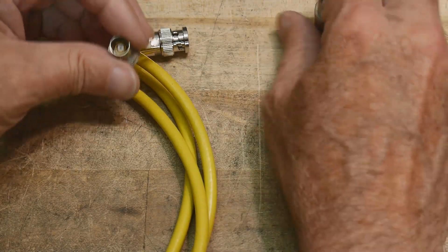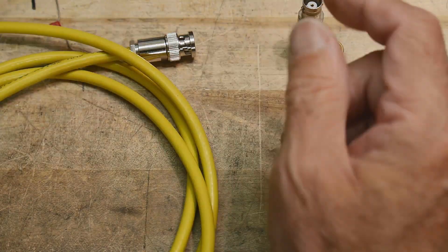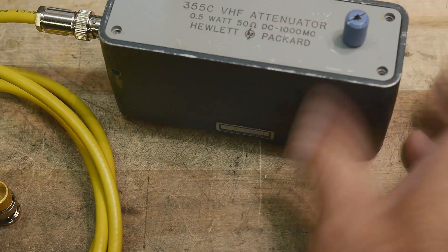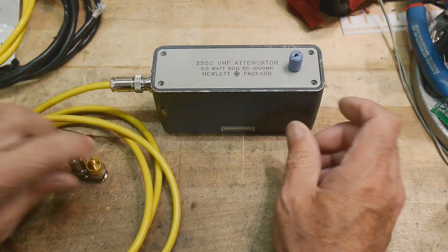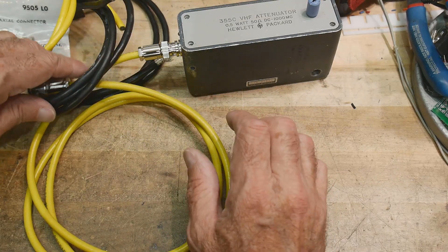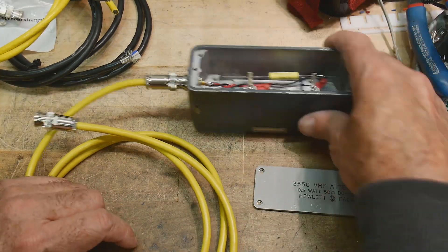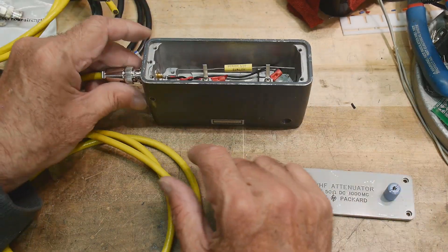I had to file off two of the little nubs, and now I have it working. I had two of these so I've already installed one in the box. Now I have an official triax-to-triax box to use with my Keithley — the real deal. I'm hoping these cables are a little quieter since the old cables would create noise in the system when moved. I just got done making this.